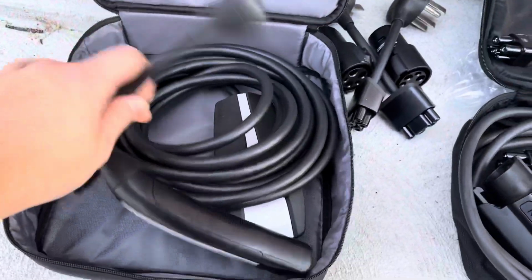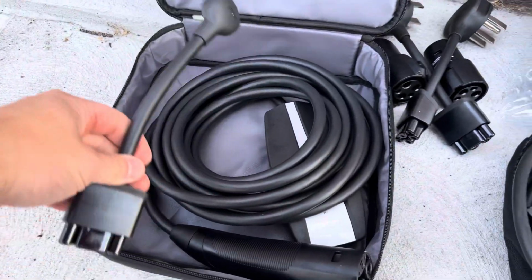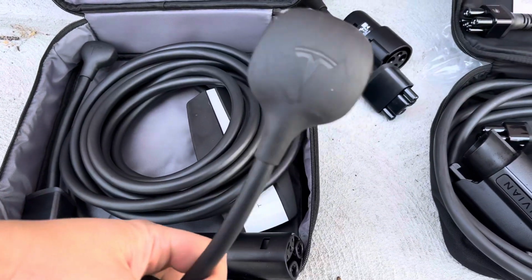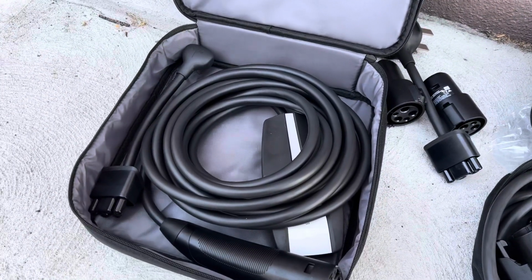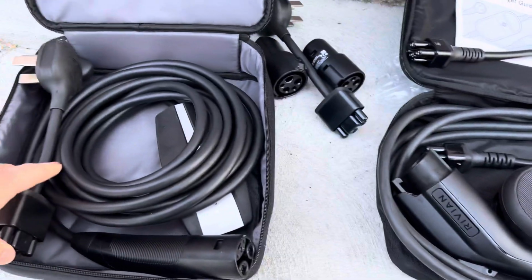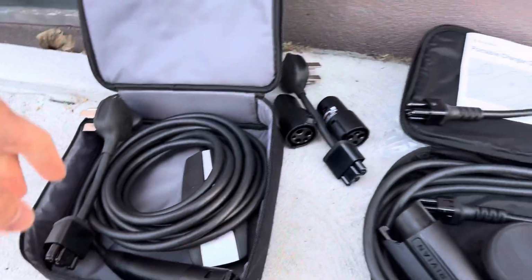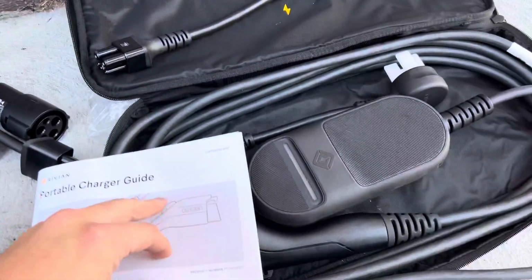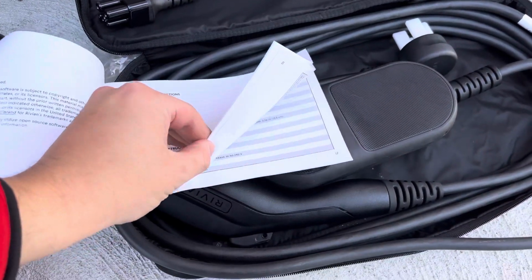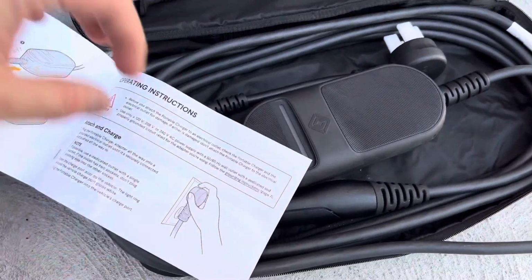These days, with the Tesla mobile charging unit, they give you the 110, 120. Depending on when you purchased the vehicle, they do give you the 220, 240, but for now, they require you to buy this adapter on the Tesla shop, or the Tesla High Power Wall Connector. And this charges at a max rate of 32 amps. In most cases, like the Model 3 and Model Y, I believe they are capped at 40. Some do have 48 amp chargers, so they charge slightly quicker.